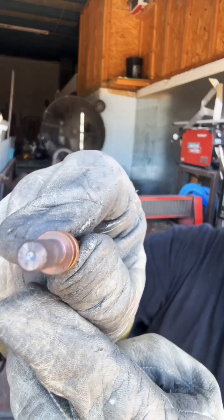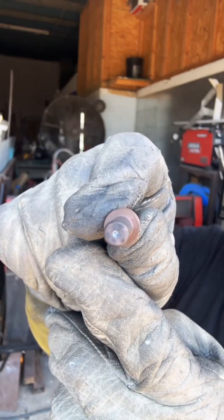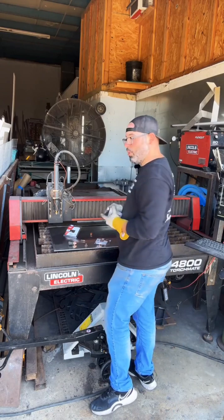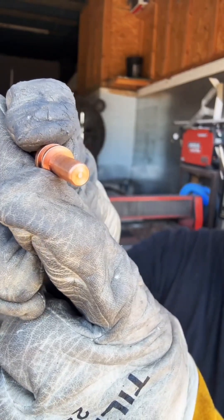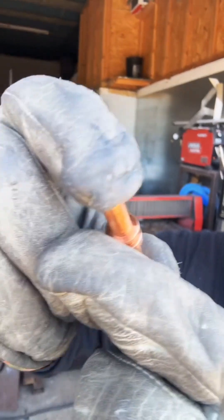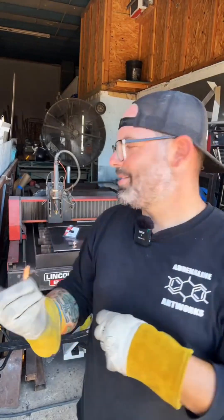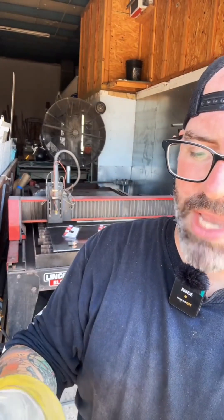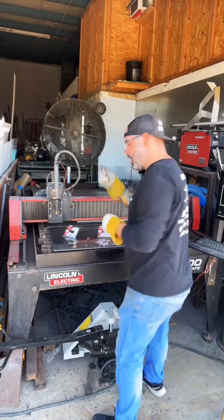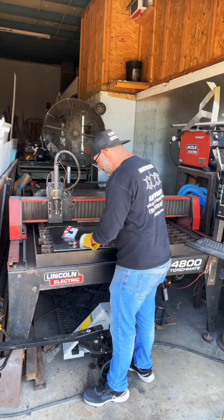This one seems to be still okay — still in decent shape, not quite needing to be replaced yet. But I'll show you the difference between this one and a new one. You can see that edge on the end is very nice and flat, and that little speck in the center is where the electricity comes from. You just push this up into the plasma torch. Side by side you can kind of see the difference. These go bad regularly but do take a little while before they need to be replaced. We're going to still use this one because it's still good.